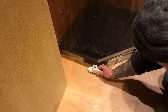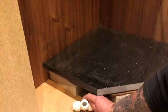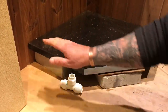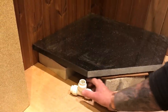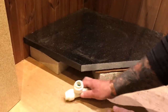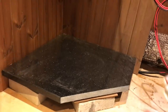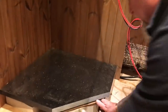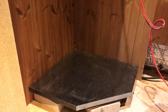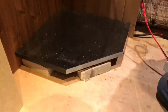So now when we come off that and the skirting is to the top of this, we'll have plenty of room, because you've got to allow for the thickness of the wood as well. So there'll be plenty of wiggle room there, so we can put that vertical pipe into the rads. And to be honest, to the fire it doesn't make any difference anyway. And we'll put a wooden skirt around here as well, won't we? Yeah, we were going to do that anyway.